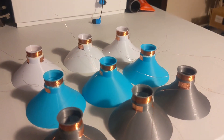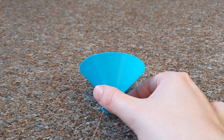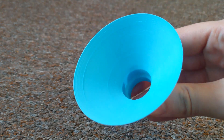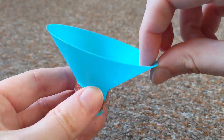The three cone shapes are designed to help highlight key areas I want to explore. The first is a 45-degree flat cone. This cone is a good centre point that we can tweak from, and so it gives a good baseline as to how useful the material will be. It also allows an equal amount of chance for the material to buckle in either direction, highlighting if a material is struggling to cope.